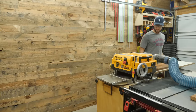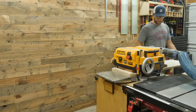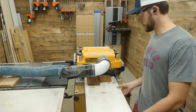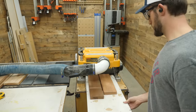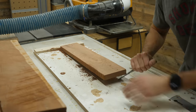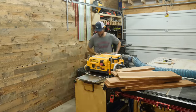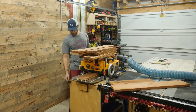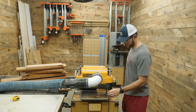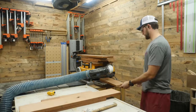I had to let this wood acclimate in my shop for a while before milling it down, which is why it's completely covered in dust. I've covered this probably 25 times in previous videos, but I don't own a jointer, so I used a planer sled to get my boards perfectly flat on one side. Down in the description, I'll link to a video that covers this topic in depth. While it does work and works really well, it is insanely slow and not at all an efficient use of time. The reason I do it is because I work out of a one-car garage in my apartment where I only have access to a single 15-amp outlet running on 110 volts, which causes this to happen a lot.